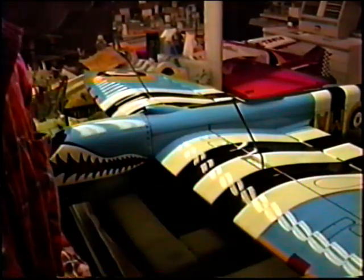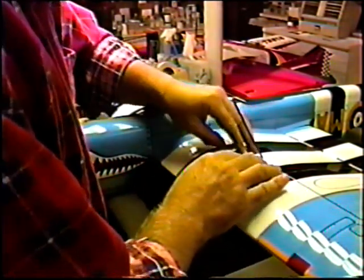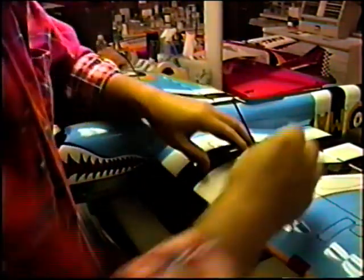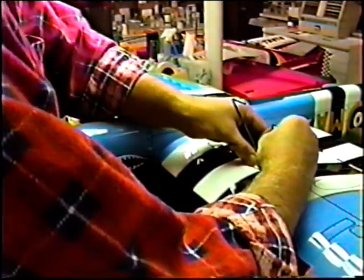Many times that I've done this, I've tried to rush the job and not bother to bolt in the gear doors. Well, you pay later on. The aluminum screws, by the way, are a nice little weight saving. Another thing you can do with the aluminum screws is not leave them any longer than they need to be. They need to catch the length of the blind nut, but don't put 1-inch long screws in, or you kind of defeat the purpose of having the aluminum screws for the setup.